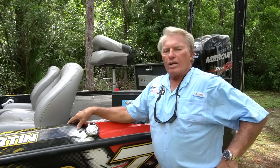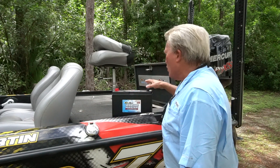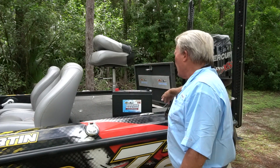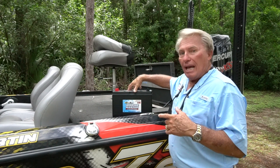Let's talk about other questions — what about charging the battery itself? How should you charge batteries? One thing I like to do is use a trickle charger. When I'm not using the boat a lot, I use a trickle charger that has about two amps of current, and it drops even less than that. In the case of an AGM battery, it's probably less than an amp, just to maintain its self-discharge. All batteries self-discharge, but AGM batteries self-discharge less than a flooded or wet type — probably half as much self-discharge.